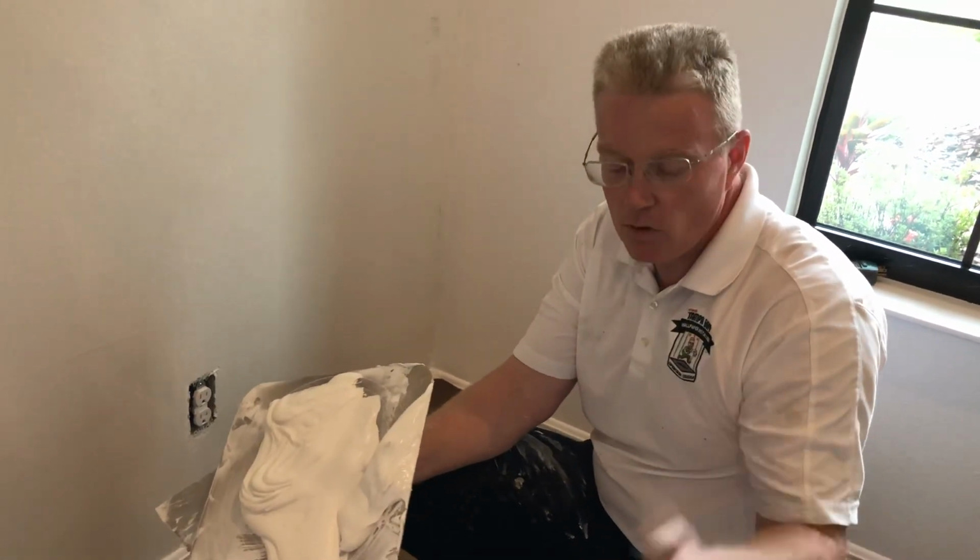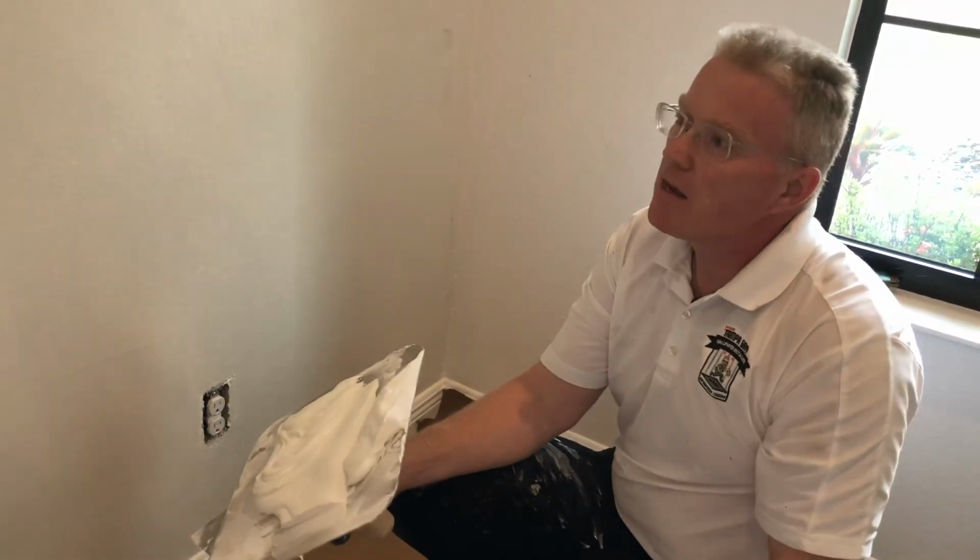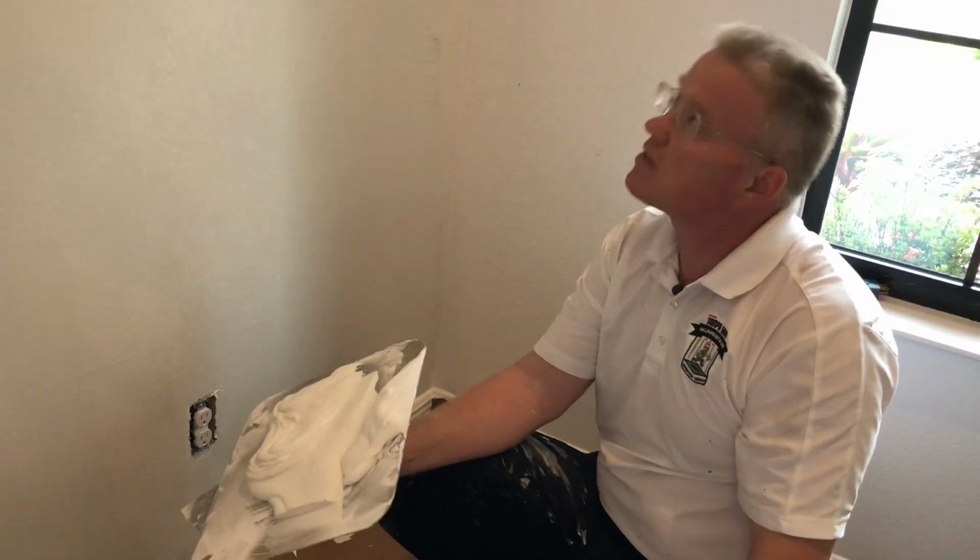And so this is a level 5 finish, as it's typically called in the trade, meaning that all of the wall surfaces are united at one level, from the substrate all the way up to the top, covering all of the valleys and gullies that are created by this texture. This one will take 3 coats. Normally it takes about 2, depending on how deep the texture is.